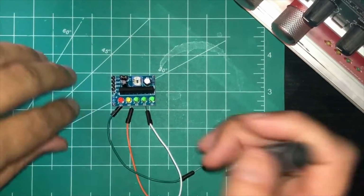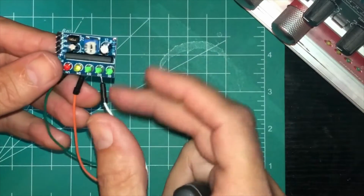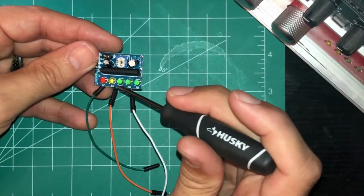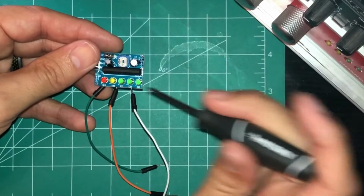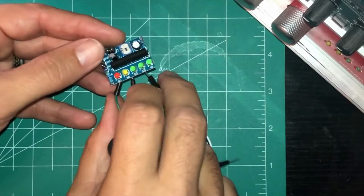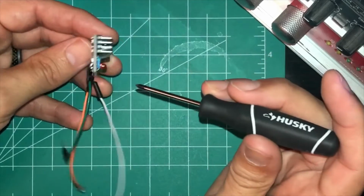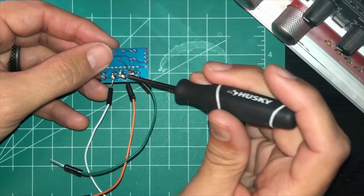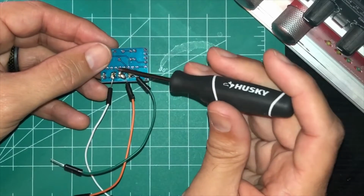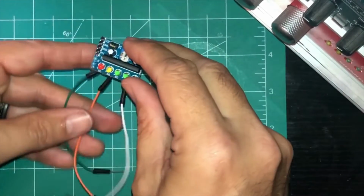The sound module thing here, you're gonna need to solder some wires on. That's why I like using these male-to-male ones here. So if you look at it right here, you got 01, 02, 03, 04, 05. That's gonna be the audio level when it hears it. So on the back here, you're gonna solder it here on the 2, 3, and 4. If you look at that Jawduino PDF, it'll show you exactly which ones to solder it to. So it should look something like that.